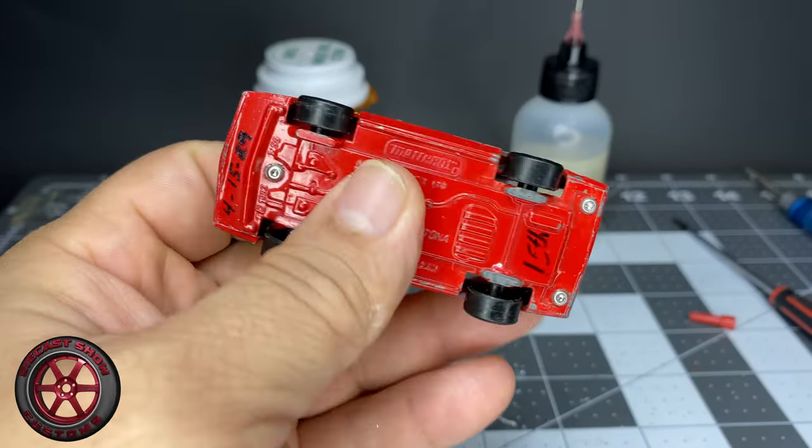Now, it's up to you if you want to use the forming or the cutting. To me, I prefer the cutting. I feel that it's a lot simpler, since with the forming you have to drill a bigger hole. When it comes to the drill, I try to use automatic chucks like this one. The old kinds where they have the key tend to wobble a lot. So dealing with such a small drill bit, automatic seems to work better.